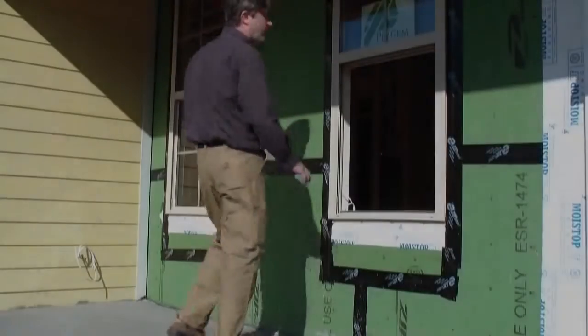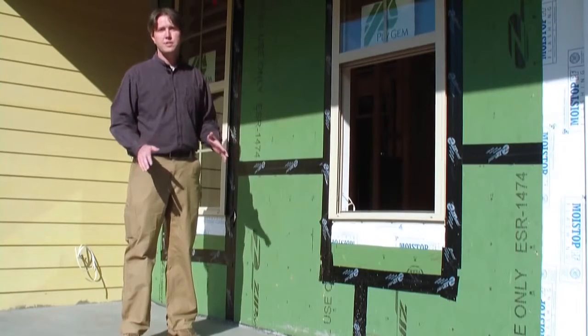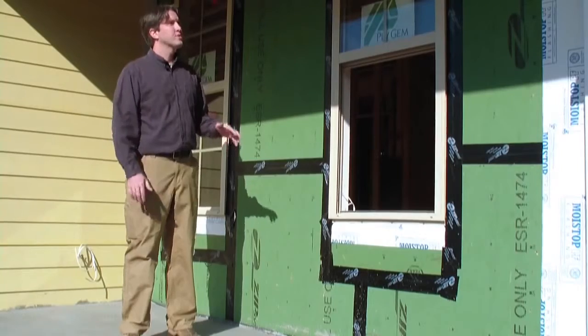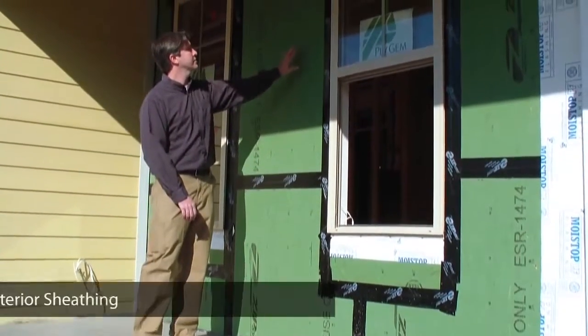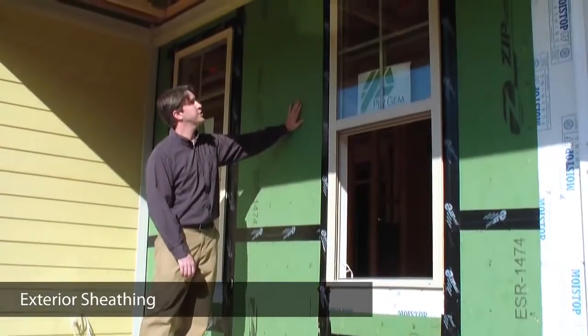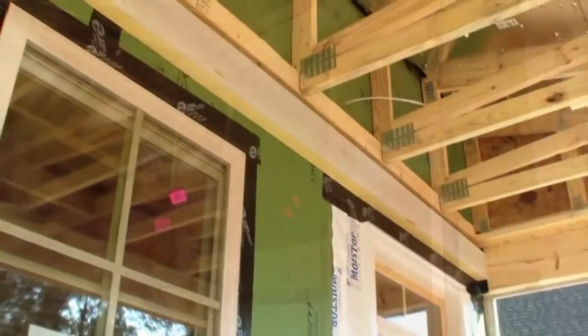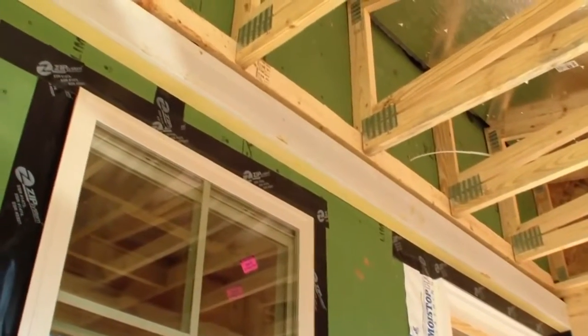In Part 1, I'm going to walk through this home and look at the framing to ensure that it's in place and ready for insulation. The first thing I notice as I walk onto the front porch is that the framer has extended the exterior sheathing from the first floor continuously to the second floor, so this porch roof is separated from the floor system inside. Now I'm going to go inside and see what I find.